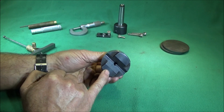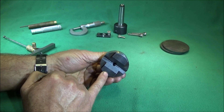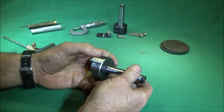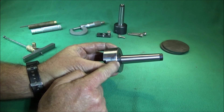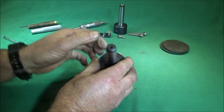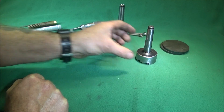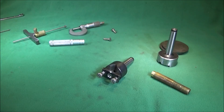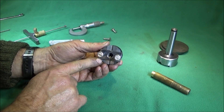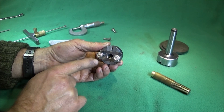Incidentally, these tools — when you buy them you think they're going to be too hard to machine because they're hardened, but when you try it they're not that hard at all. I've just tested this one and it's as soft as anything to turn, so you can actually machine them to make them into a better tool. What I really like about this tool is the ability to drill and tap components or bar dead square every time.